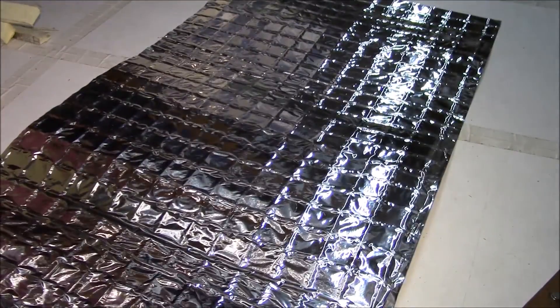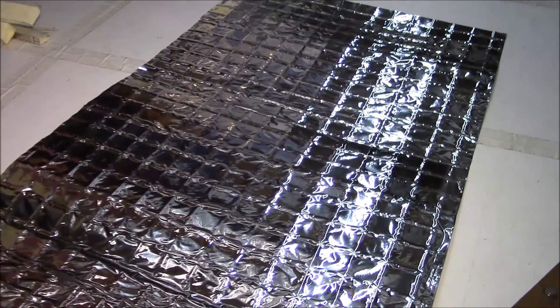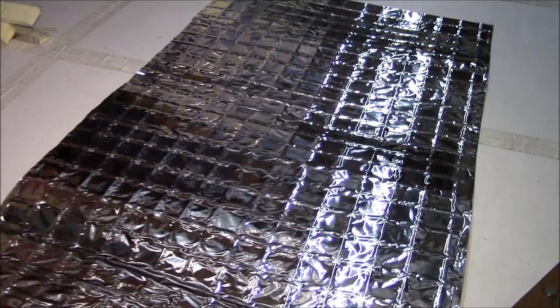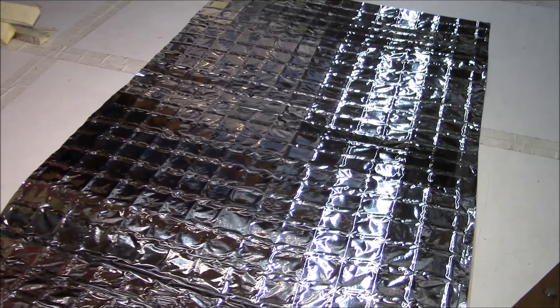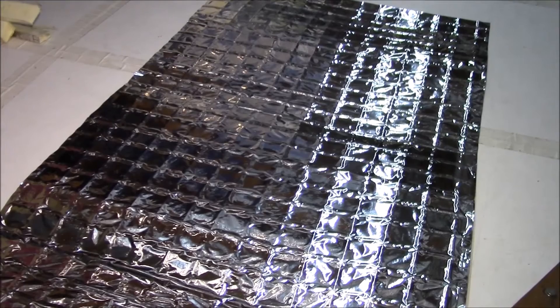Again, this was Enerflex — it's a double-layer reflective foil with a plastic stiffening mesh and three steel wires. They make it in 24-inch wide, which is what I used, and also 16-inch wide, so you get the width that matches your rafter spacing. They also make it in rolls. Unfortunately, it looks like Home Depot doesn't carry this anymore, and Enerflex may be closing — their webpage said ceasing operations in 2017 — but there are many other makers of this sort of material.